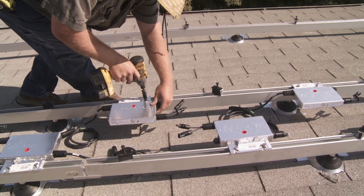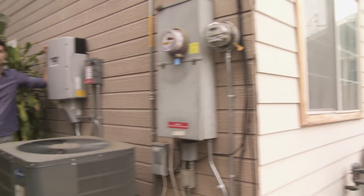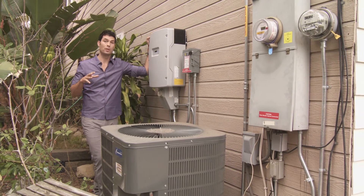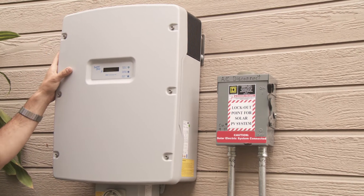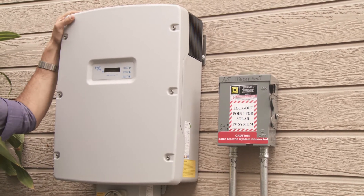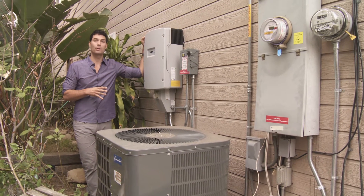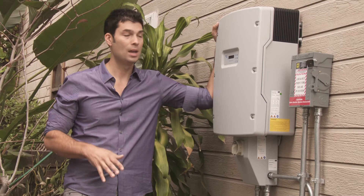This is your inverter. Inverters are really the brains of the system — they convert the DC power created by the solar panels into AC power, which we use in our homes. The inverter also constantly checks the grid to make sure it's okay to feed power onto it. This is the traditional inverter — it's mounted near your main service panel and feeds electricity into your panel for use. The good thing about traditional inverters is they've been around forever, have a long track record, are proven, and are less expensive than a micro inverter.